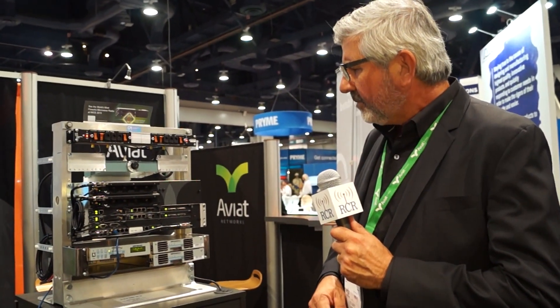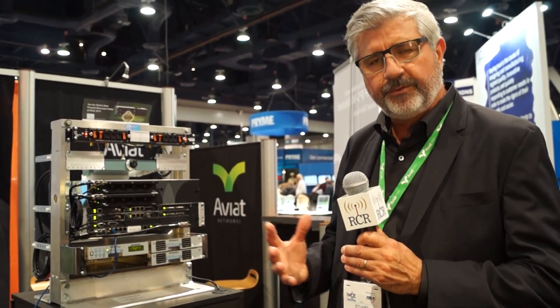With the higher power of the EHP and those extra dBs, you can potentially use the 11 GHz band instead of 6 GHz to cover the same path distance carrying an equivalent amount of capacity. At 11 GHz you can use a smaller antenna — the FCC antenna limitations are 2 foot at 11 GHz instead of 3 foot at 6 GHz — meaning you can save on antenna size and lower the cost of leasing tower space.